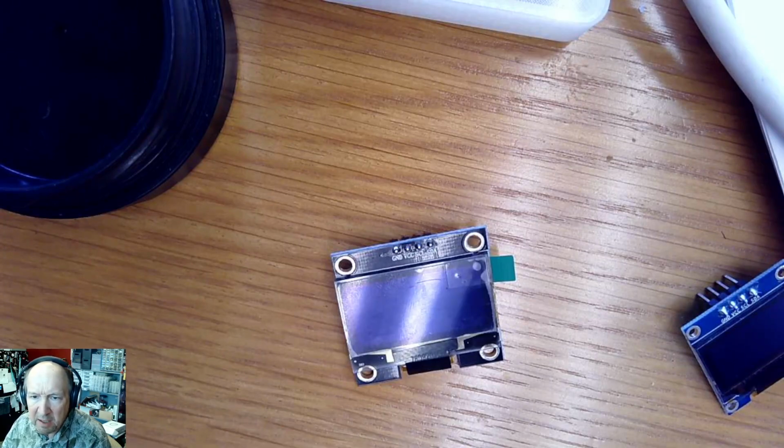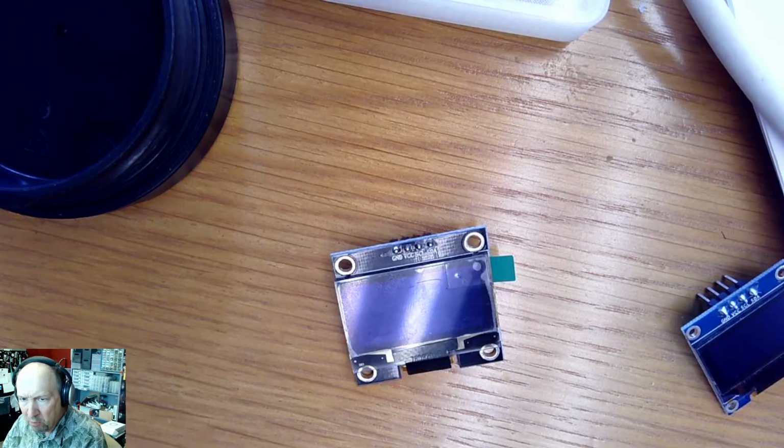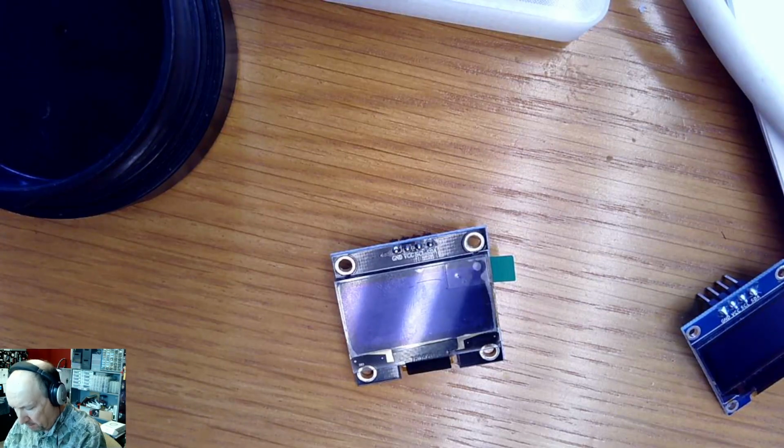A little bit hard to see on that, but on my board, I just need a connector. So I want a generic connector, and a 4-pin would be fine. So this actually will be my display, and I'll just throw that in here. Well, I kind of don't like the label hanging off. Okay, so I need a ground. Pin 1 is ground. And, you know, the order of things doesn't matter too much. Let me zoom back in here so we can see. So pin 1 is ground. Let me hit the escape key here and then duplicate the ground.